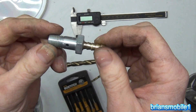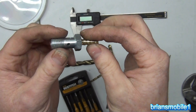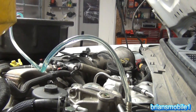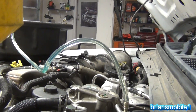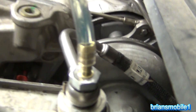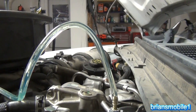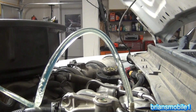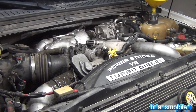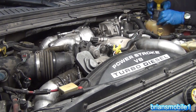About what a pain — but I think it turned out really good. I don't think you could do much better than that. It's all pressed together, there's a good rubber o-ring seal in there. I think this will be good for a lot of years of service. I'm just going to hit it one more time with brake cleaner and compressed air, make sure there's no debris on it, and we'll put it into service. The thing's flushing good — you see all that? We're going to turn this off and let the air rise for a minute. I bet this thing could start now. If you look up close, it's not leaking anywhere — it's doing good. Look at all that air! Imagine how long you'd have to crank and purge to try to get rid of that. That would take forever. We've got the fuel system bled, got the coolant filled — everything's just ready to go.